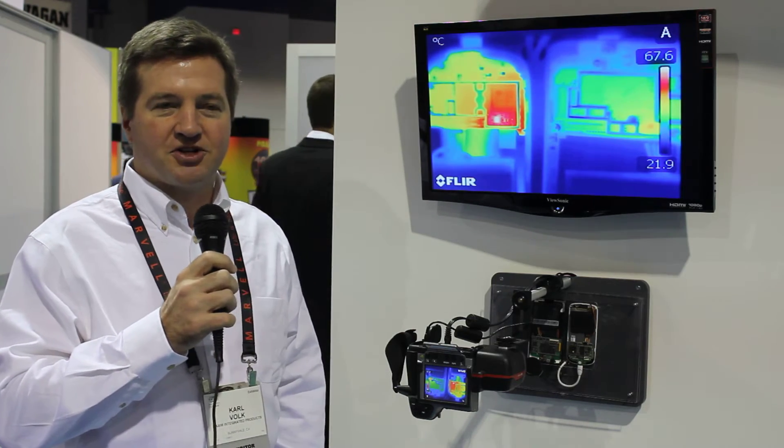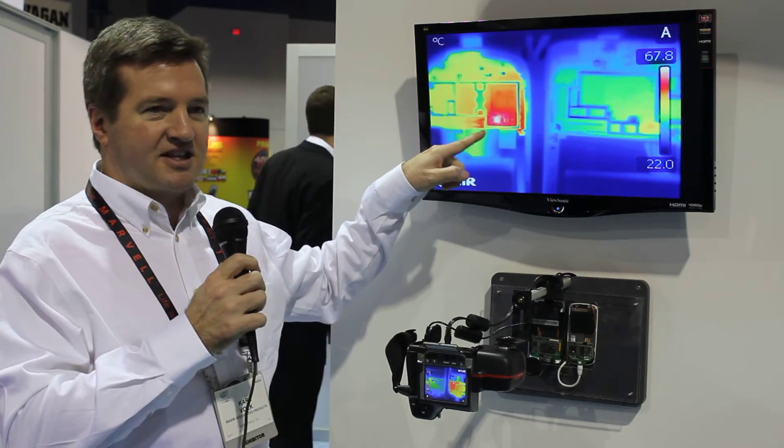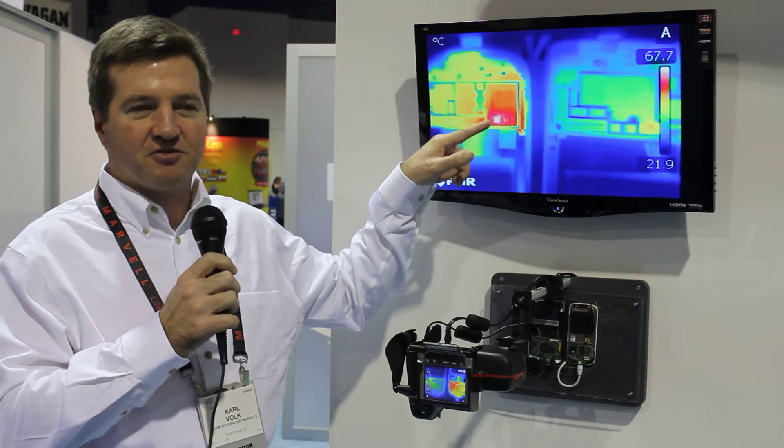The room in here is about 25 degrees C, so that's getting up to a 30 degrees C temperature rise. What that means is that they really can't increase the current, because in hot ambient conditions this could actually reach 100 degrees C on the PC board, which is damaging.